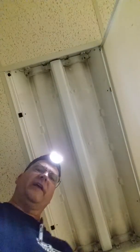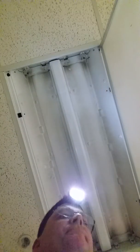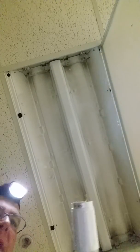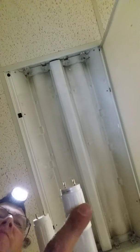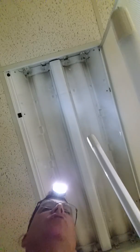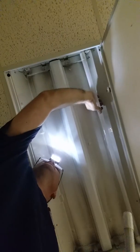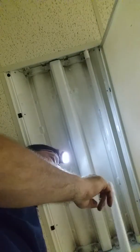All right, now we're ready to put our lamps in. So I had them off to the side. What I like to do is I'll put them both up. So again, on one side of the lamp, it has this AC input. That's important. Also, LED lamps only shine one way. They're not like traditional fluorescents where they illuminate 360 degrees. They only illuminate like 180 degrees. So they have to go in a certain way. And if you put them in wrong, they will uplight, and that's not right. You want the light to come down.